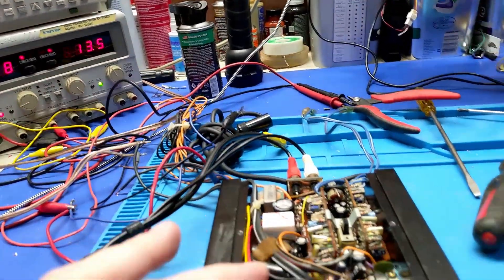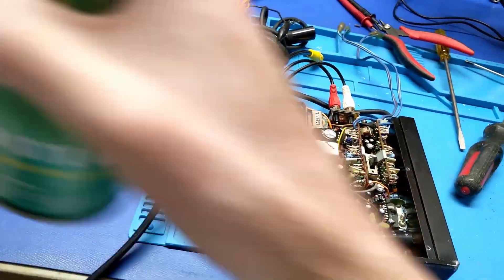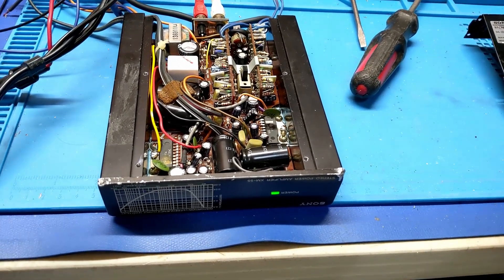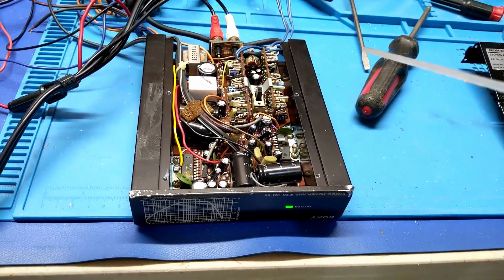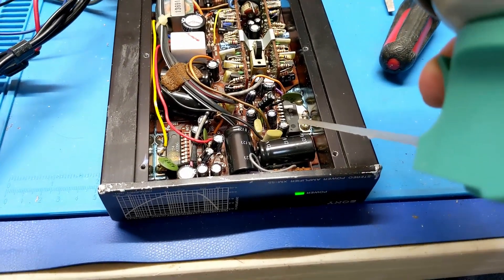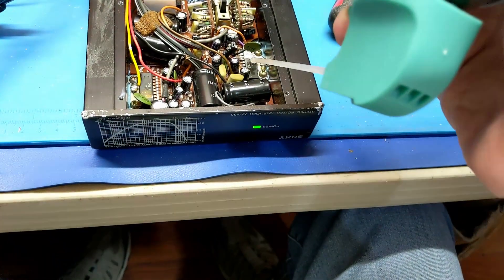It's very weak and it's a lot weaker than the other channel. It's kind of distorted, and it's probably not going to translate well on camera. It was cracking and popping a little bit and it's weaker. I've been using my can of upside-down air. If I spray the amplifier — hear it getting muffled? We're losing the high-frequency response. That chip is bad.